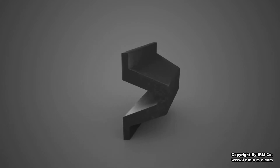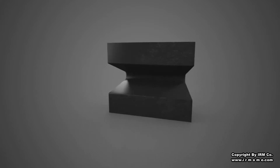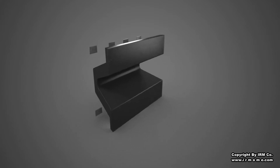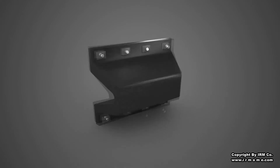The V-shape of these fenders helps to disperse stress evenly. These fenders are manufactured by compression molding in a single piece, with steel insert plates encapsulated in the legs to provide a firm fitment with the jetty.